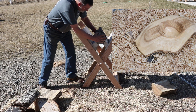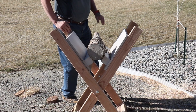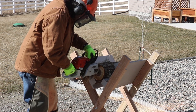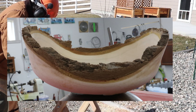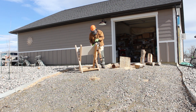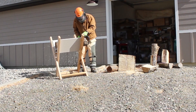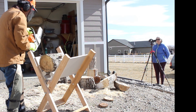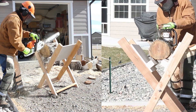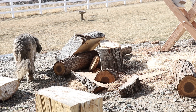I'll go back to this log — a crotch that I cut right down the center — and I'm going to make a video showing how I make a wing bowl from it. Here I am cutting that walnut log again. I love this saw buck, it really works well. This natural edge bowl is finish-turned less than a quarter inch to completion and then sanded. The best way to cut is with the log on its side, and it's all about the shavings — you get nice fat long stringy shavings when cutting like that.